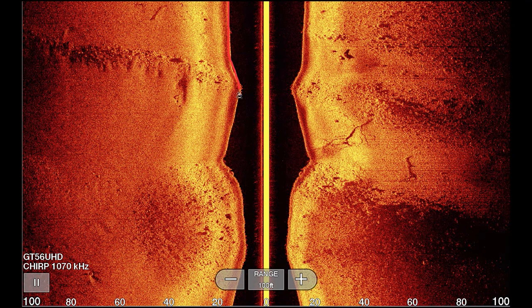We have this large black area directly to the left and right of our transducer beam — that is the water column, so all this black area is water. This is not the actual bottom of the lake. The first line where it goes from black to a very hard return — that is the beginning of the bottom of the body of water. Going outward, we are shooting 100 feet to the left and 100 feet to the right, as shown by our range set to 100 feet. So we are cramming 200 feet of information onto one screen, meaning objects can look extremely small but be rather large in real life.